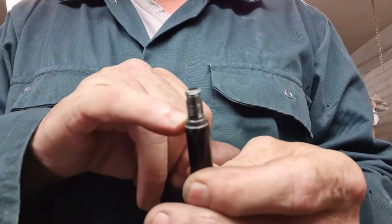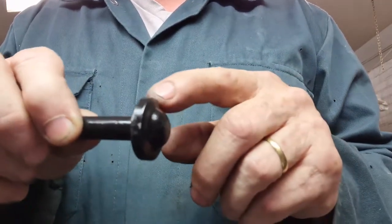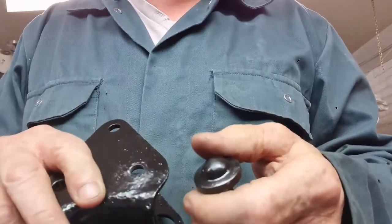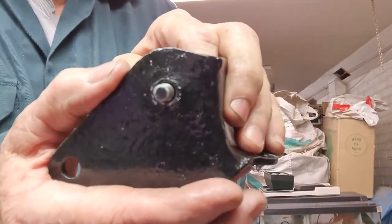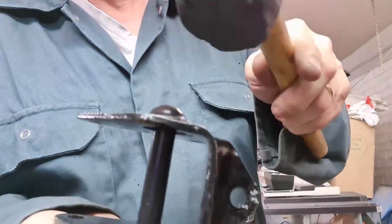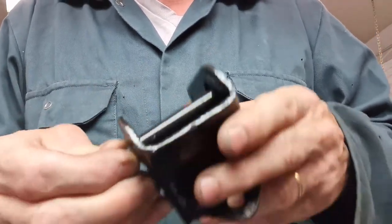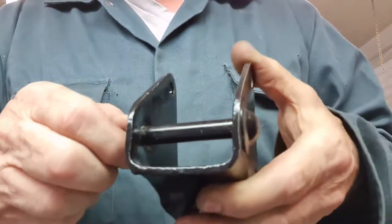The diameter of the shoulder part is 0.360 inches. What I've done is left the paint on these on purpose, and left the paint in the holes on purpose. You could put Loctite around here to make it tight, because you want both of these holes to be tight. So you line it up so there's an equal gap all around that 5/16 thread, and then just tap it in. You can't do this too many times or it's going to make it loose - you don't want any play in here.